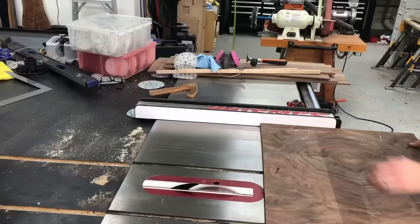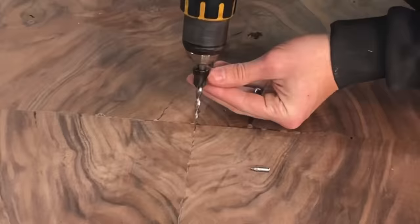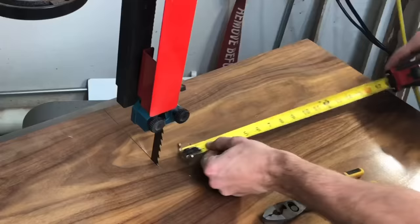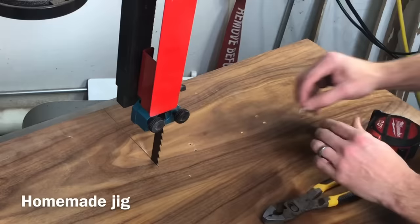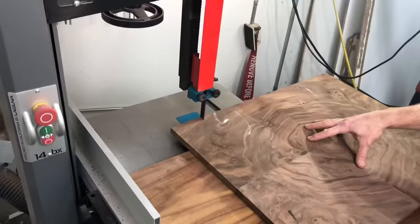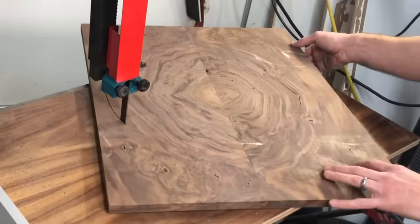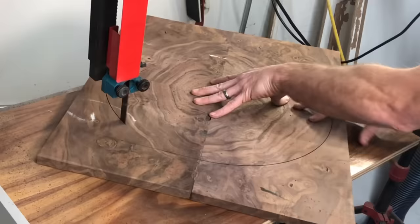From here, I just need to get it small enough to run on my circle jig on my bandsaw, and that's why I'm drilling a tiny little hole there. I have the cut-off end of a 16-penny nail that I'm just going to set in that hole, put that on the center of my board, and now it's going to rotate in a perfect circle on that nail head. It's a really simple jig that works perfectly well — you just set the nail head in the hole and it will give you a perfect circle every single time.